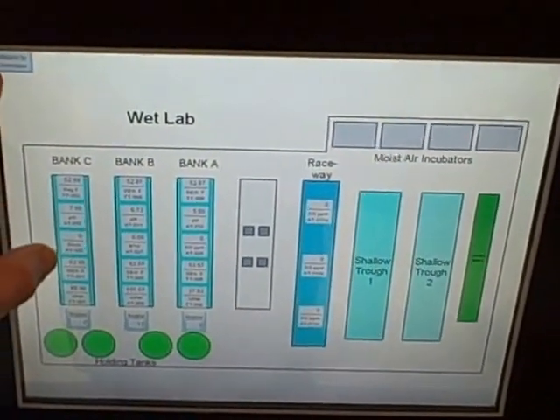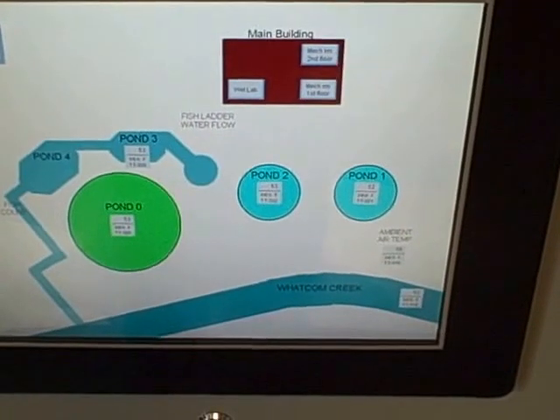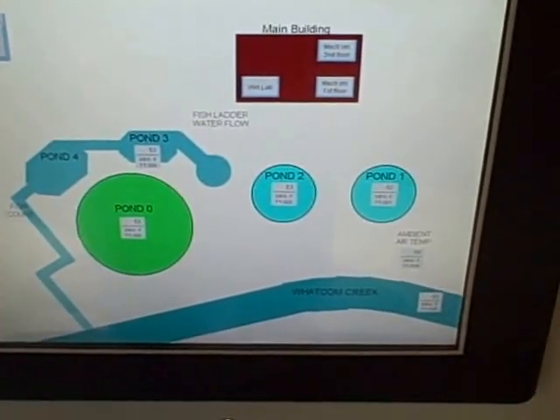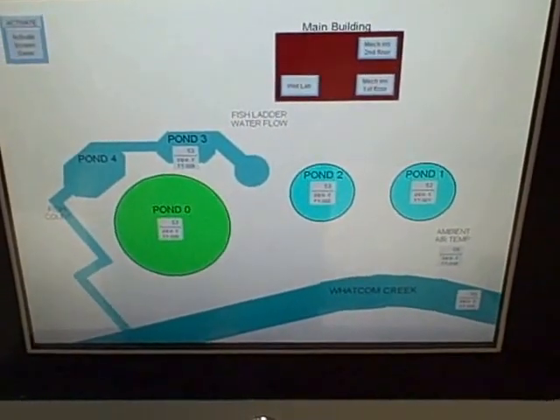This spring, what we've done is install some wireless HART instrumentation. These are field instruments that are battery-powered and use the wireless HART protocol to relay information back to the HMI. The gateway for the wireless HART devices talks Ethernet to the HMI. I'll show you where that is right now — we'll step out and see where the gateway is.